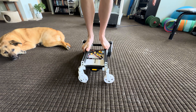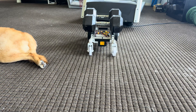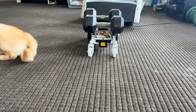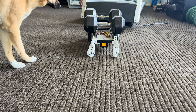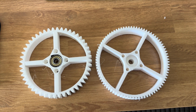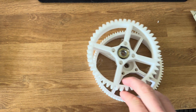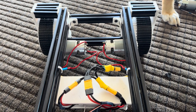So clearly this was a huge improvement. But the next question was: can it move any weight? I loaded 70 pounds on it and as you can probably hear, we did not have enough power. So I just increased the number of gear teeth — seems like an easy solution, right? — which certainly gave me more torque, because with me holding onto the cart you can see how much earlier the wheel spin starts on the left wheel.